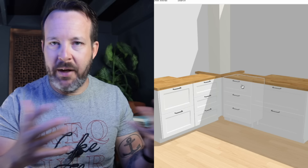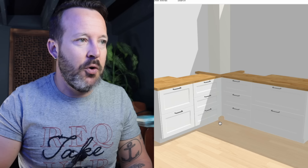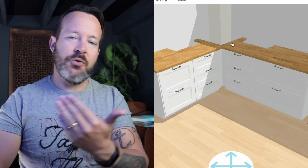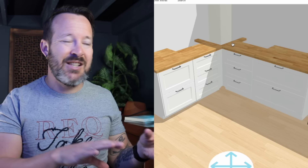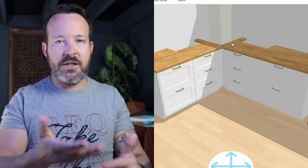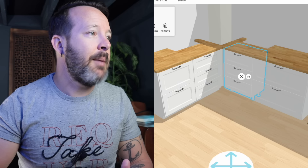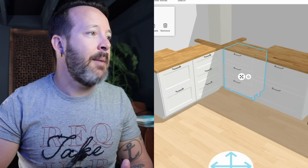In 3D mode you can see this odd-shaped selection of cabinets. Just another thing you can do if you have pipes or other obstacles in the corner that prevent using a regular corner base or full-depth cabinet — use shallow cabinets. Of course there's no reason in this specific corner why I couldn't just put a regular-depth cabinet, but I want to show you the option. Maybe there's plumbing from a sink or dishwasher around the corner — there are lots of ways you'd have a blocked-up corner. This allows you to think outside the box and create a corner that's very workable without needing full-depth cabinets. So that's six ways to design a corner base using IKEA cabinets. Hit the subscribe button if you like this kind of content, and we'll see you later.